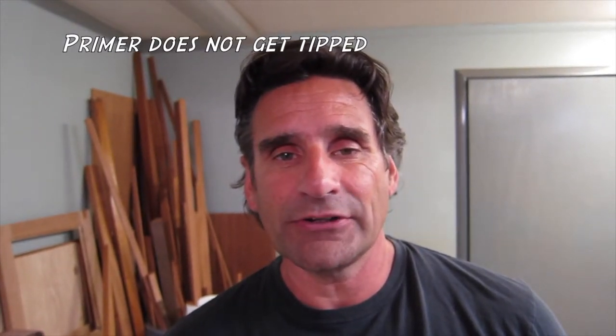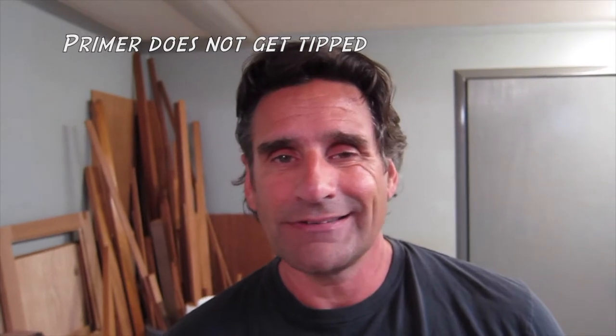The only thing I really found that was difficult was the primer. It rolled on pretty good, but using a brush with it didn't flow out good and it was drying quickly on me. It could just be operator error, but I've done it a lot of times since then and it's always a little bit the same. You just put a lot on and then sand it off. That's the way to get around that. The paint itself, a little goes a long way, and that's a good thing because it's not cheap paint. And I overmixed a lot in the beginning, so that's one thing to be aware of. So anyways, now we can really get to the pictures.